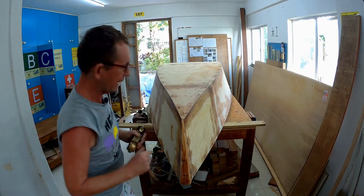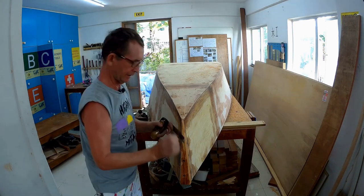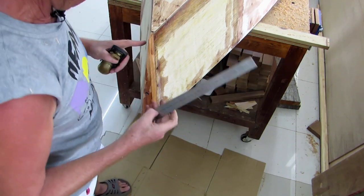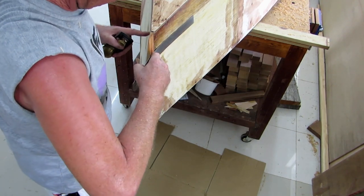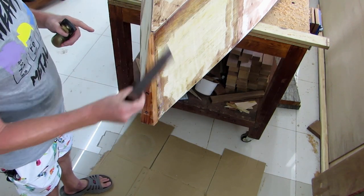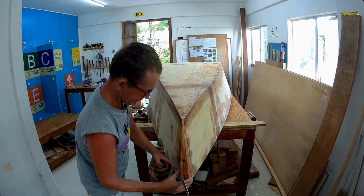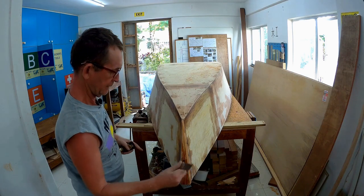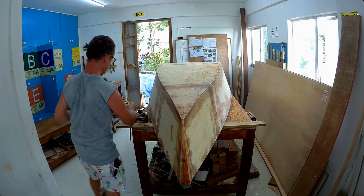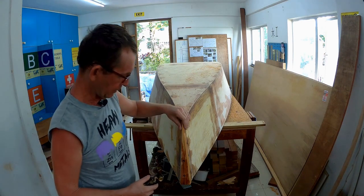What I do is I run a straight ruler along like this because of the curve, and then we can see the curve. Now we're going to have to fair it a little bit in here. I can't get the plane in there and I'll end up having no stem left, which won't be a good idea. We have two almost to a point there — almost perfect. When we put this in like this, there. So we will fill this in and shape it into a fair curve.